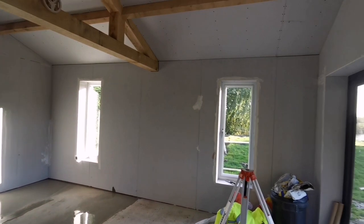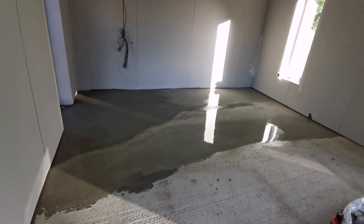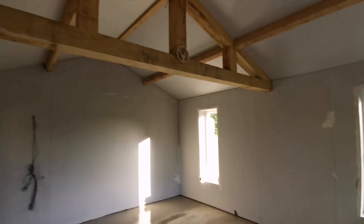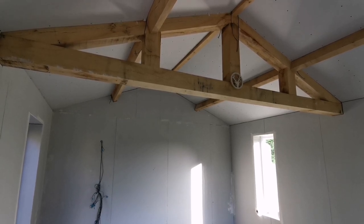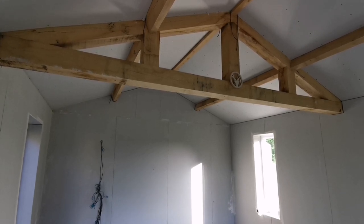So when we come back, we're going to be tiling, put some self-level down. If you can remember when I concreted this floor, I was struggling for time to get it in because the concrete was coming. So we got it all in and I only had 80 mil at this end. So I pulled it forward to get us 100 mil all the way around because we had 130 at the back, I think it was. So we've just self-leveled that, so it's ready for tiling. So that's the next job, guys. Tiling in here. So I will see you in the next one.